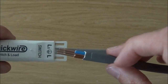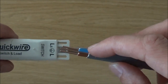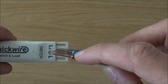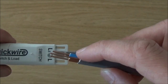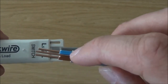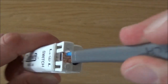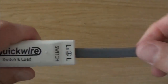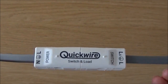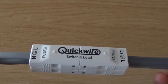The switch cable is slightly different — we use the brown wire to take the power from the ceiling rose down to the switch, and then we use the blue wire to return the live or switch live back to the ceiling rose. In a normal wiring setup we would place a piece of brown tape over the ends of the blue wire to indicate it's being operated as a switch live. In this scenario, the little 'S' on the terminal indicates that it is the switch live. We're going to put the blue wire into the terminal labelled 'Ls'. Locate the wires into the holes, push, resistance, and click into place. And there — you have just wired an entire ceiling rose. Done slowly for demonstration purposes, but you can see how that could be done in a matter of seconds if you'd already identified which cables were doing what.